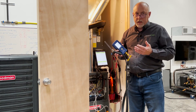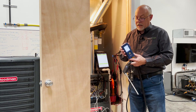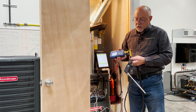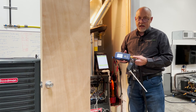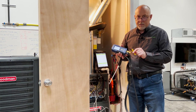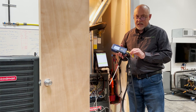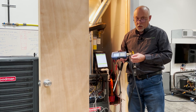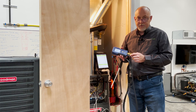There are a couple reasons we really like this analyzer. Number one is for its size — it's a very compact, well-made analyzer. It's got a fiberglass housing that's super tough with a rubber side molded display. The other big feature is the simplicity of the connections. It uses two K-type thermocouples, which is important — we use the second K-type either for temperature rise or for combustion air temperature to get an accurate combustion analysis. Having a K-type thermocouple instead of an expensive adapter definitely cuts down on cost. Also, AccuTools upgraded the probe assembly, so the strain relief is a lot better than earlier models.